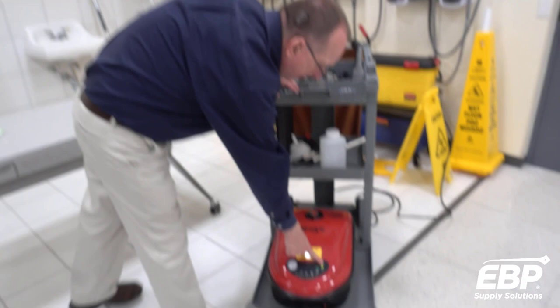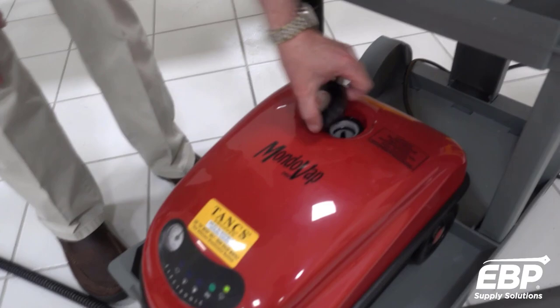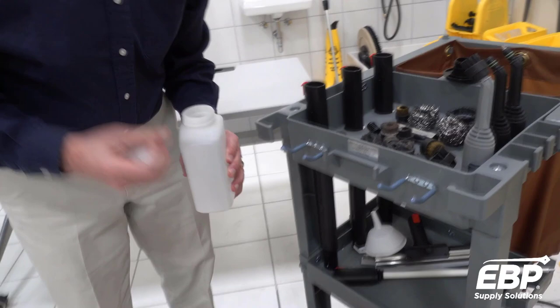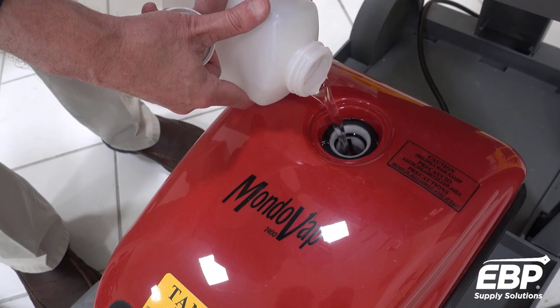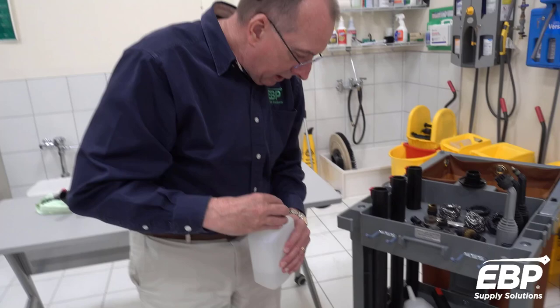One thing to talk about is water. If the boiler ran out of water, you would run out of steam. So how do you check the water? You can open this at any time — the water is down a couple inches there. All you do is fill up the water. I like to keep the water about a quarter of an inch below the lip. Then put the cap back in and you're ready to go.